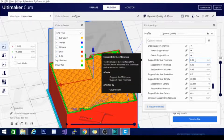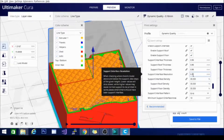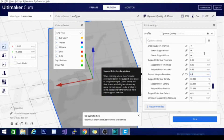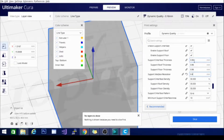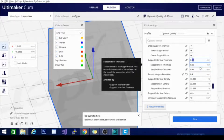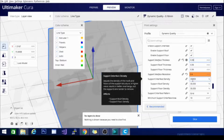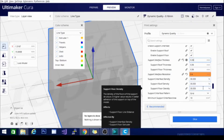It's almost a millimeter of filament just to prevent contact with the model itself, so that's kind of a waste. I have that quite high — I don't think I need it that high. We do need to change the resolution to be close to our line height so it's not printing two of them per line and wasting travel time. I can set this to 0.3, or let's do a multiple of our magic numbers — 0.36, because that's a multiple of our nozzle width. Support interface density is set to one third.